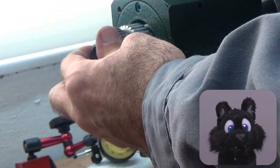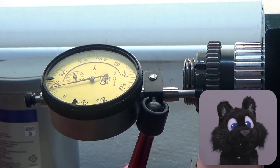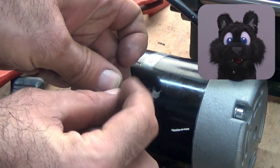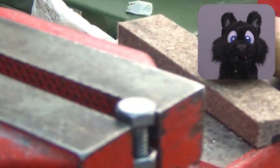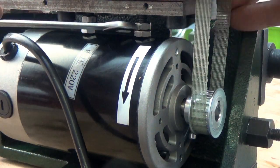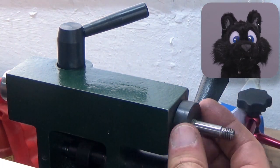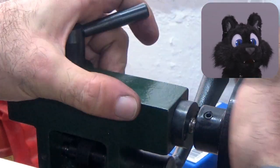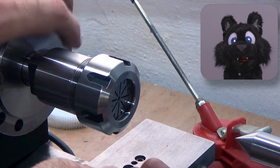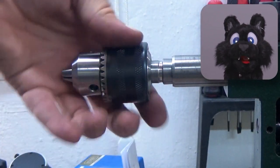The spindle has the drive belt pulley and a gear to drive the lead screw — and that gear was quite crooked, requiring some tuning. The belt tightening screws are just regular machine screws that push against the motor, evident by the scratched surface — I'll file them flat to prevent any more scraping. The tailstock is built to allow adjusting in all directions, which is important because you want the head and tail spindles to be on exactly the same axis. I used a collet in the head spindle as a guide to adjust the center on the tailstock — at least the two ends meet. I still need to look into the full axis alignment.